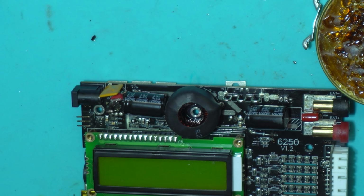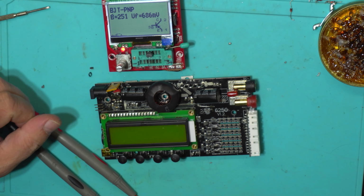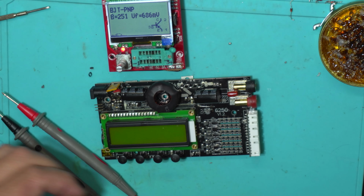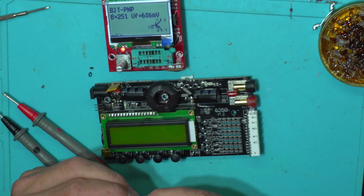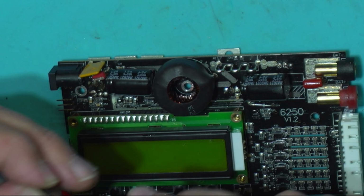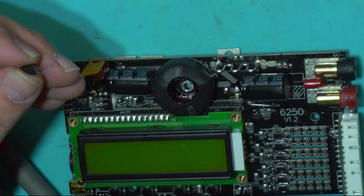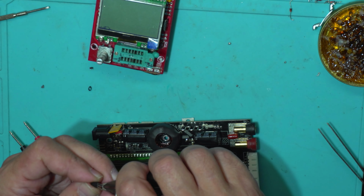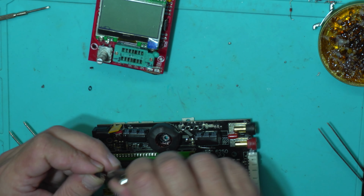Now it's time to find a transistor like that. Well, I couldn't find an SMD, but I found this one, so it's looking okay for this job. Now I have to plant it on the board. Shouldn't be a big problem. Base, collector and emitter. Base is in the middle, so I'll do a different approach for a better placement. I'll just cut the collector like that.